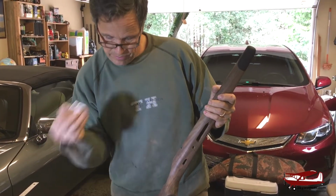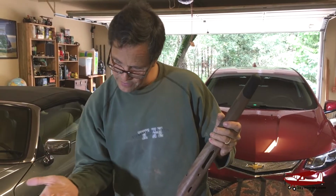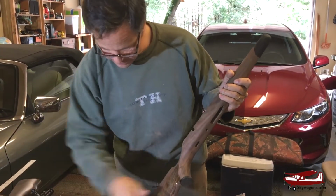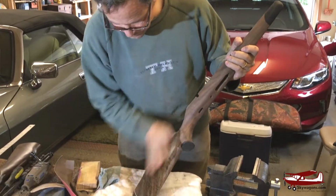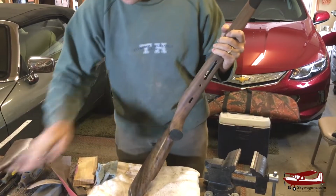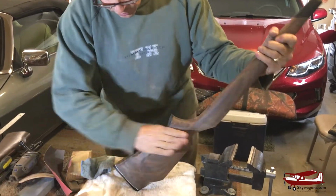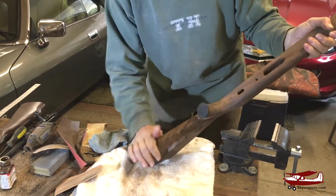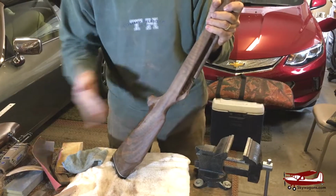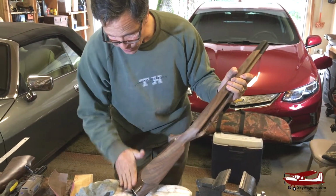So you literally just put it on, there's a bolt in there which helps stir it. You put your hand over there and you get some on there, and then you just rub it on. And it just goes in, and it's not a finish, it's literally a grain sealer. So once it's on, you just let it dry a little bit and then sand it back off, back down to the surface of the wood. So the only sealant that's left is the sealant that's inside the grain. So you're left with a flat surface of wood with no holes.